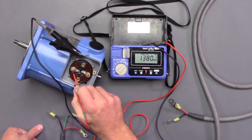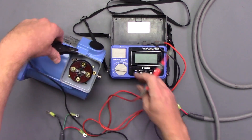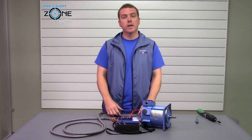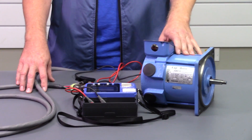Same thing with B. And always after we're done, discharge the megger. Now if you had found anything less than 300 mega ohms, we're going to ask you to bring either the motor or the cable in so we can get it fixed and properly repaired.